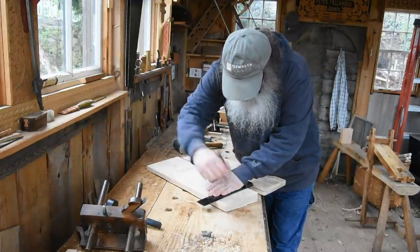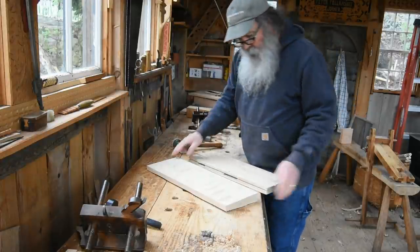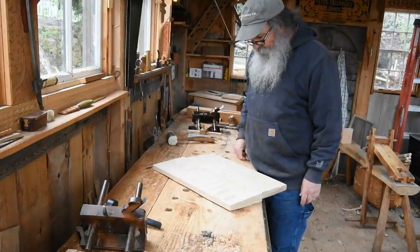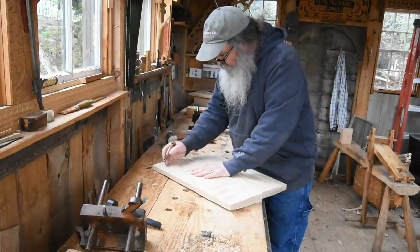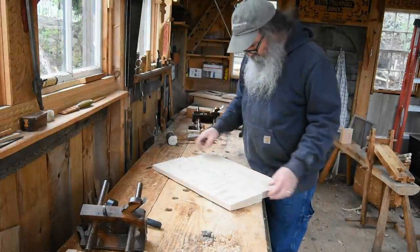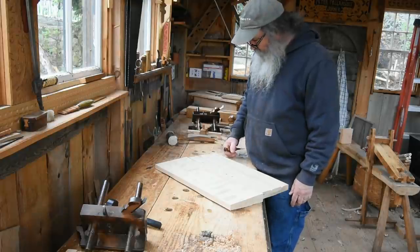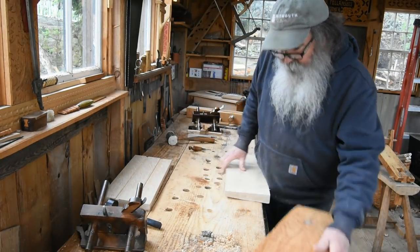These pieces are not easily replaced if I mess up. This one is marked March 5th, and it is today May 5th — so exactly two months ago. What I really needed were those shoulders. I can carry the rest of it after the moldings are cut — I just don't like to scribe that line across the moldings. I like to have that before the moldings go in. But it's a matter of transferring the mortise lines and marking the thickness of those joints, and that's all pretty standard stuff. We'll jump ahead to cutting the moldings first with a plow plane.